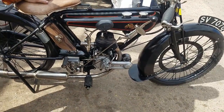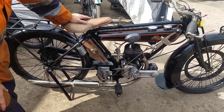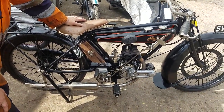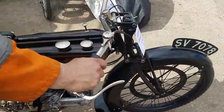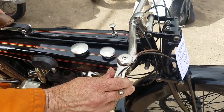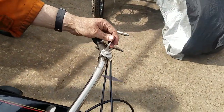There's no great deficit because it is a total loss engine. It burns and throws out what it doesn't need. Obviously, in years gone by, they wouldn't want to waste oil. They'd use only minimal oil. So we'll fire it up. This is the black magic art of trying to find the right place to put these levers. Both open a little bit, and advance about halfway.